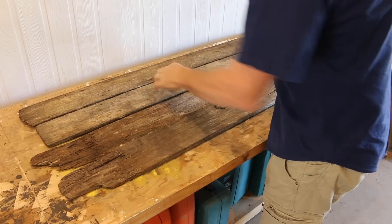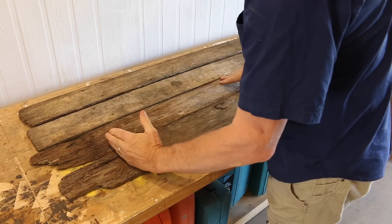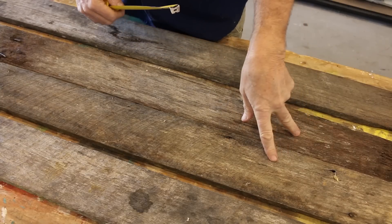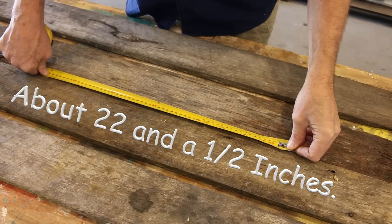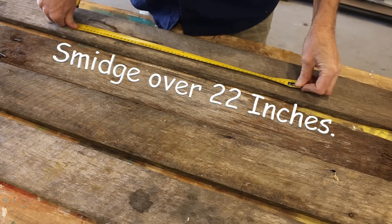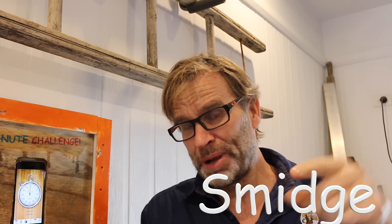We'll have two pieces for the back and two for the side with a shelf and a top, and that's it. The first cuts are going to be these two backing boards and then the two side boards. The two backing boards will be cut to a length of 570 millimetres, which is about 22 and a half inches. The two side pieces will be cut to a length of 560 millimetres, which is a smidge over 22 inches. How much do you think a smidge should be? Leave a comment below — I'm thinking about two millimetres, a bit under one eighth of an inch.